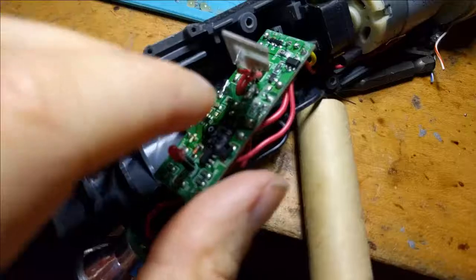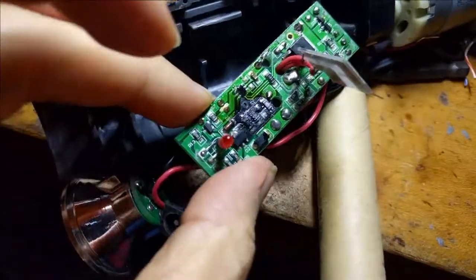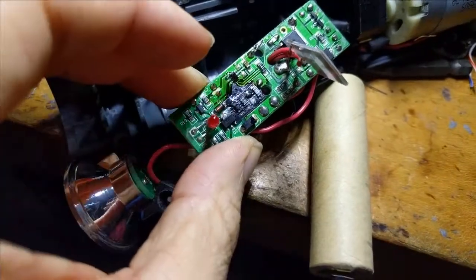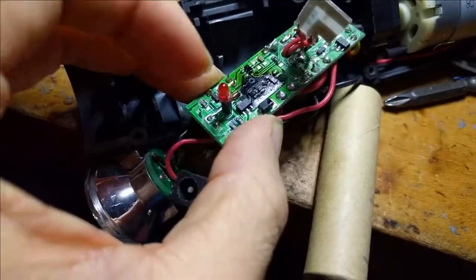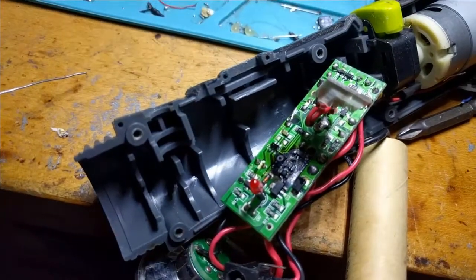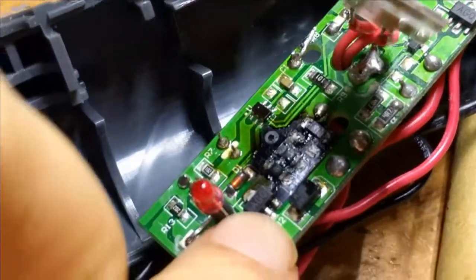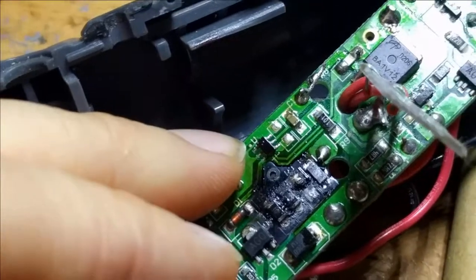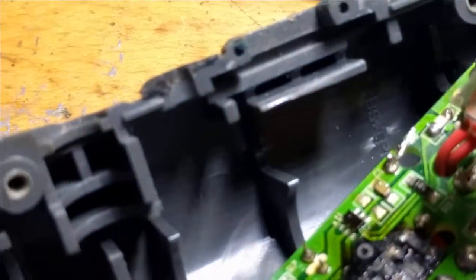This is actually quite bad — one of the worst burns from just a power supply at very similar voltage I've ever seen. I'm pretty sure the cause is this diode here. You can actually see the tab of it kind of burned off a little bit, and then it went after the resistors next.